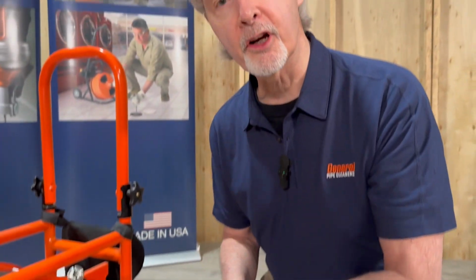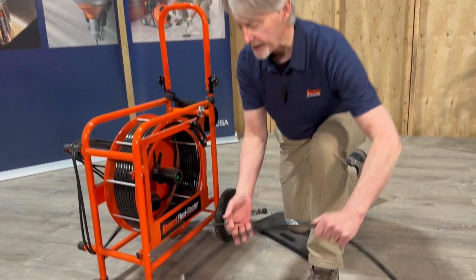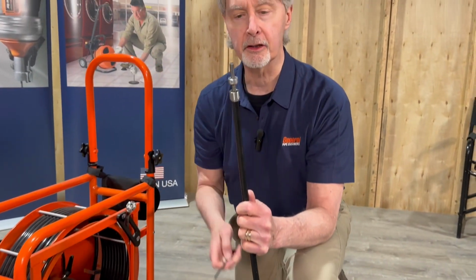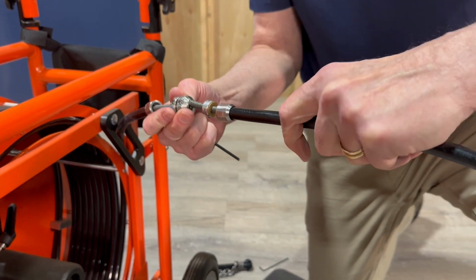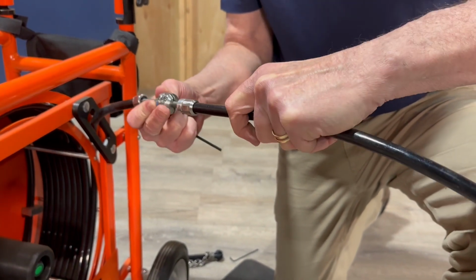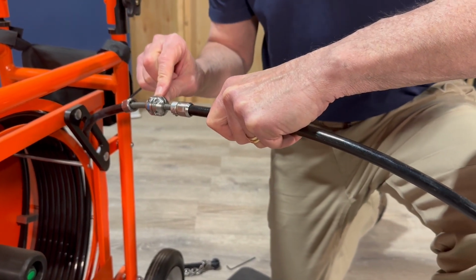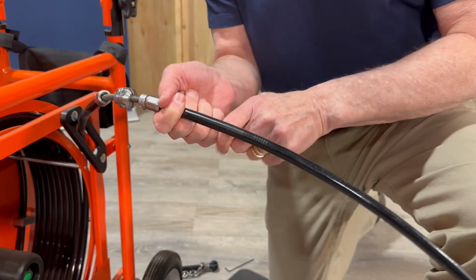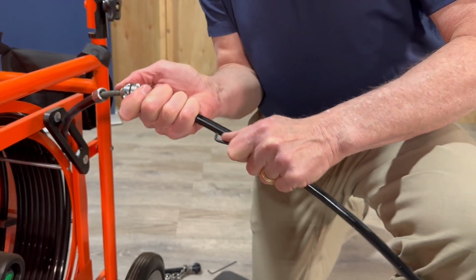And then take your 25-foot extension and stretch it out in a gentle arc around whatever space you happen to be in. Hopefully you have enough space to do this with 25 feet. And then take the back end, that would be this end, and insert it exactly where you had the chain knocker on the machine before. Just push it in to the front of the flexible shaft coupler, and using the largest of the 3 Allen keys, you tighten it down.